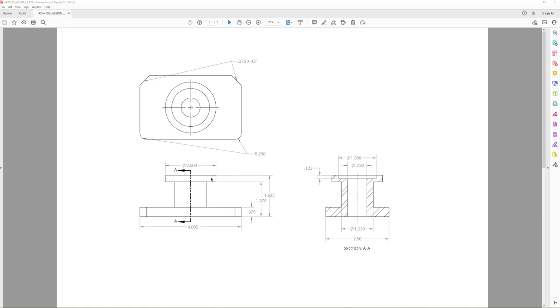The next feature at the very top — we're going to start on top of this shaft we've just created. We'll have to do a little more math: it's going to be 1.625 minus 1.375, which is a quarter of an inch. The diameter of that feature is two inches, as indicated by the diameter symbol here, and I believe it's a quarter of an inch thick.